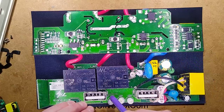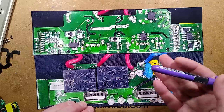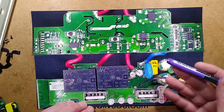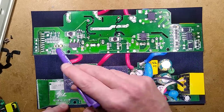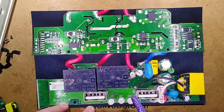The relay contacts are rated about 10 to 15 amps depending on the standard — I wouldn't really trust them for very high current. There's no thermal protection if the relay contacts start melting; there's not enough room in this thing for protection. They've just crammed so much into a small space. The white LED — you can see the phosphor — is controlled directly from one pin on the ESP receiver.